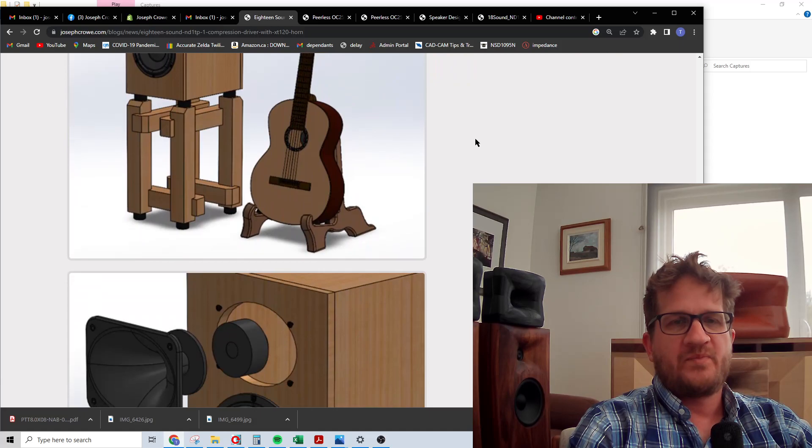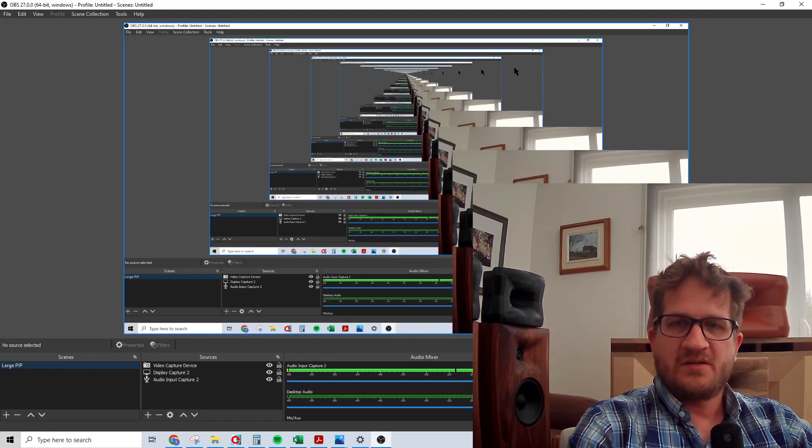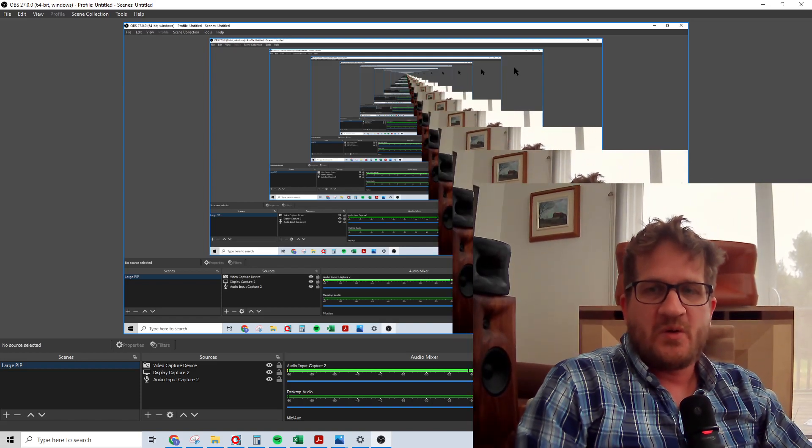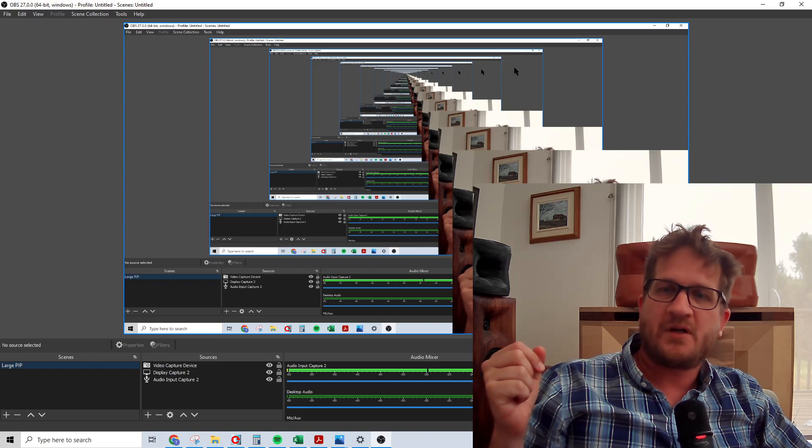I've built a pair of test cabinets — one-inch thick Baltic birch, 40-liter cabinet tuned to 30 hertz. I'm using the ES 800 horn on it just for listening evaluation of the driver. Ideally I'd prefer not to use the ES 800 in the final plans since I want to offer something truly off-the-shelf. It may be that I need to offer a 3D-printed horn solution — I now have a number of suppliers for 3D printing where I think I might be able to offer that.